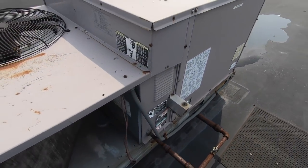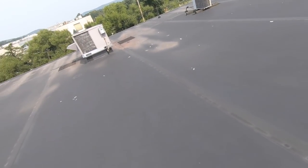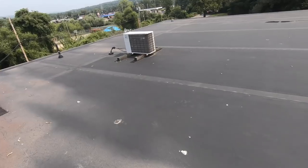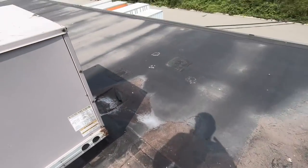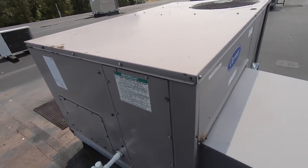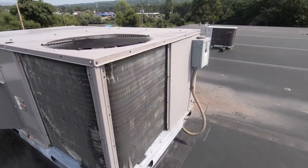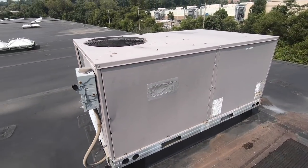Nothing's labeled, and I have water around everything, but this is on top of that server room. I also have a ductless split there on top of that server room. My drain doesn't look like I have any action, nothing coming out of the drain. All right, I'm gonna guess this is unit two.